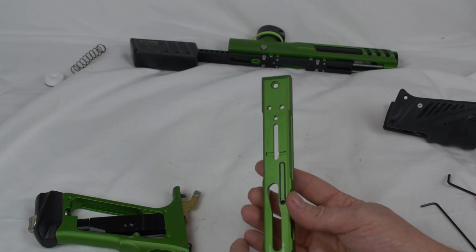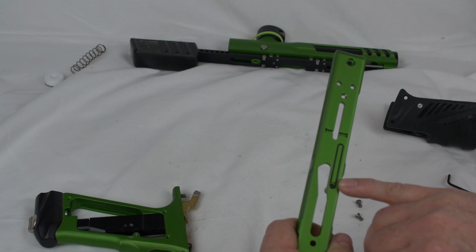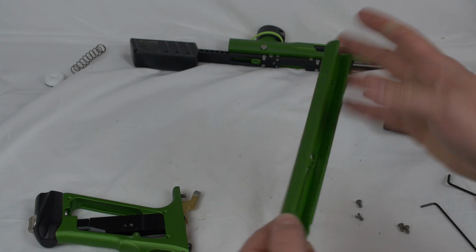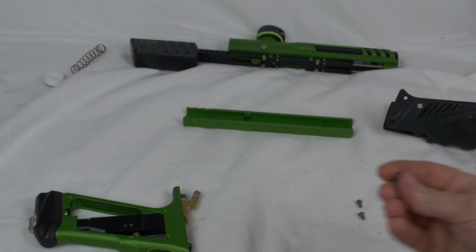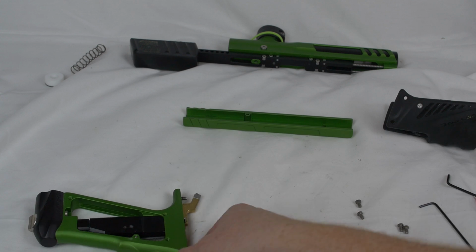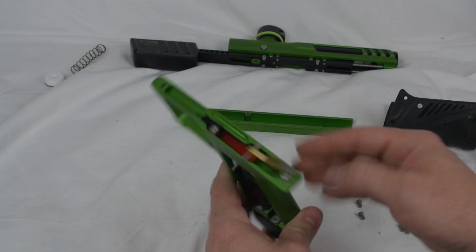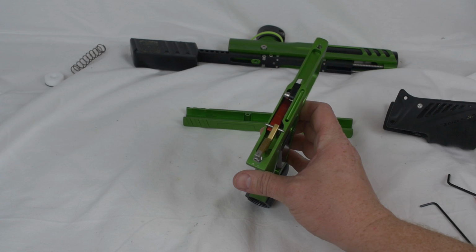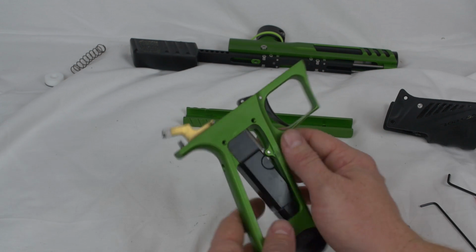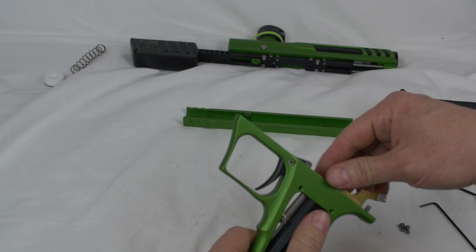So we have what's referred to as a racetrack O-ring right here. It's our air passage. And typically these guys are Loctited in. Like I said, the back one's contained right here. You can see the other air passage from our regulator. Our trigger dowel pin, don't lose that guy.